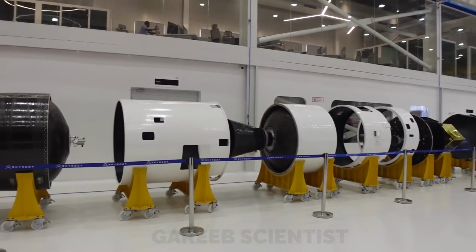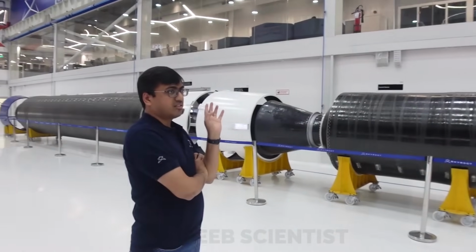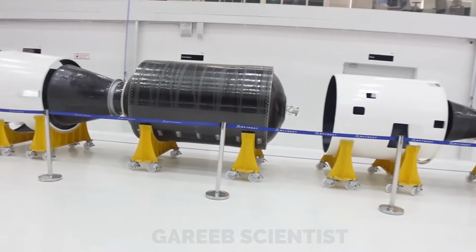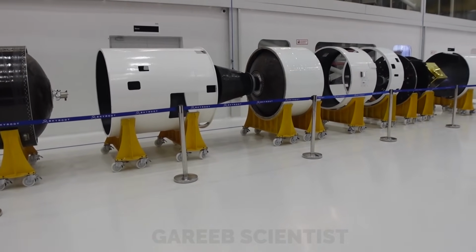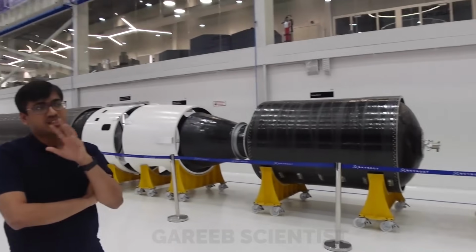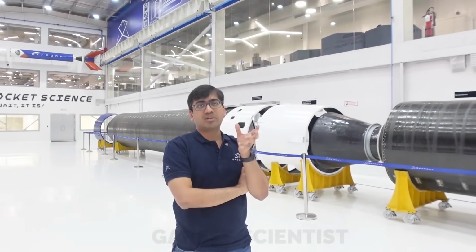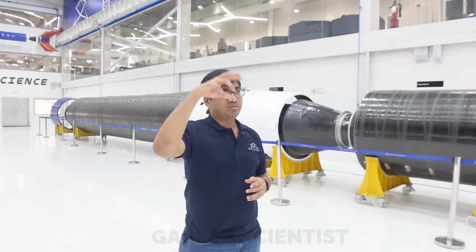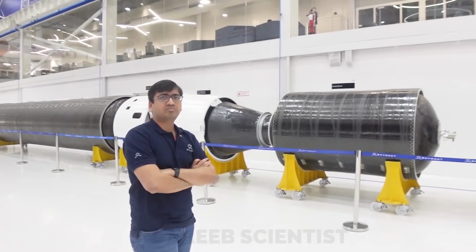And you have to build a new tool, because this length is different and this is heavier. The stage one tool is massive, a 12 meter high pressure tool, which only a few people can manufacture. So once the size becomes bigger, the tooling becomes more complicated, and handling becomes more complicated: moving these structures out, putting them, aligning them. That becomes a challenge. Otherwise, the tech is more or less the same.